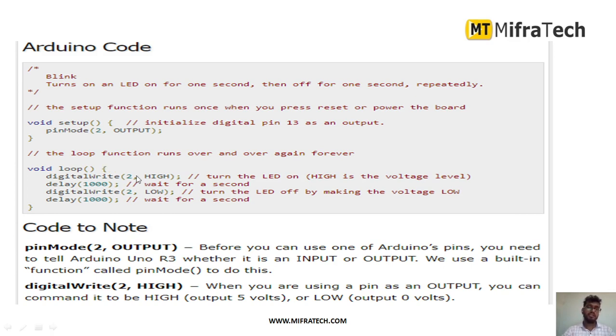After another 1000 millisecond delay, it will go high again as written in the loop. In this way, after a one-second delay, it will turn on and turn off repeatedly. So in this way you can interface an LED to the Arduino microcontroller. You can write the program and dump it into the Arduino microcontroller and run it.